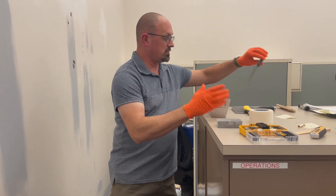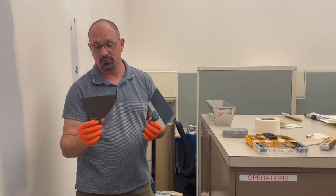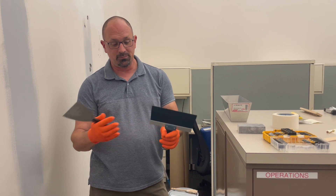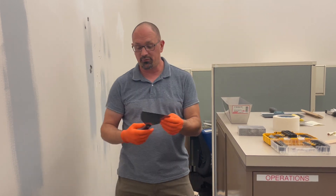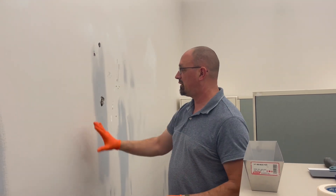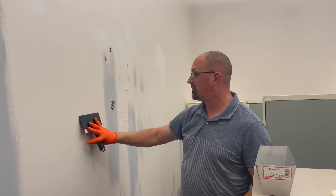The other things that we use are drywall knives. You have all different sizes with drywall knives. You'll have smaller versions, and you'll start getting into larger versions for taping or mudding bigger areas. It's whatever works — for the areas we'd be doing here, a smaller knife works. If we have a larger area that we're trying to fan out, then we would use a larger knife.